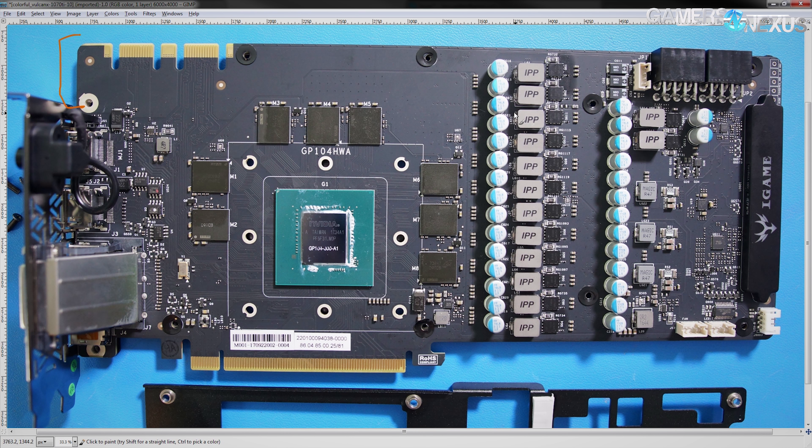So let's get right into it. You have the PEX VRM down here, which is normal for basically all NVIDIA cards. This VRM outputs one volt and it powers the PCIe interface as well as some internal PLLs of the GPU core. It's very important for keeping the card working but completely useless for overclocking until you're well below zero, so it's only really worth worrying about on liquid nitrogen. It's always just a fully integrated buck converter like we have here.